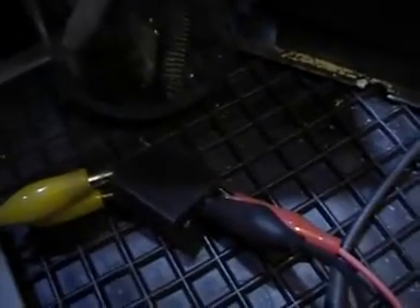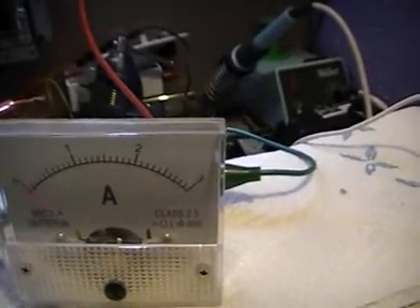Now I'm doing something about it. She's getting one hell of a pulse from the 555 timer circuit I have here — just a bog-standard one-second pulse which is operating this microwave 12-volt relay, which in turn is operating this microwave high-current relay. I think the contacts are 10 amps, and then that is feeding the primary of this microwave oven transformer and then into the battery.